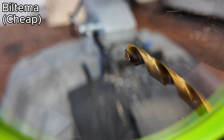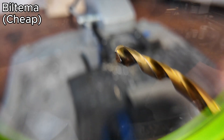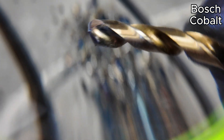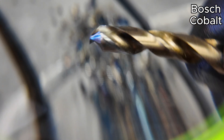It's 20 holes — this is a real stress test. Honestly, kudos, hats off. For this price, it held up pretty good for 20 holes. It is dulling a lot — it feels more dull when you push the drill press. You can see the chips are different colored. There is higher friction getting out the chips, which causes a blue discoloration of some of the chips. You don't get the nice spiral-looking ones, but it is still cutting at a decent speed. The cobalt bit looks good — it's not that damaged. The times are really holding up. Very, very good. I am actually impressed.